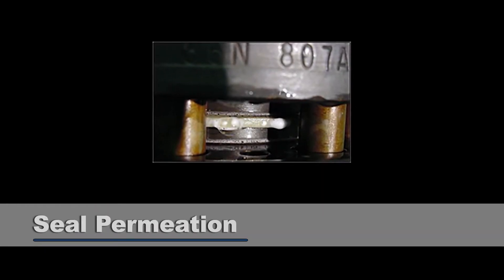The linebacker was invented around 1968, commercially available in 1972. This product has a GRE retainer with elastomeric or PTFE seals. The problem is that the design can have permeation between the two seals — as shown in this image, nitrogen at 400 PSI is permeating through the glass-reinforced epoxy. That's not surprising because when you look at glass under a microscope, it looks like a straw, and the media flows straight along it. Some clever people decided to cheat that leak path by making a tortuous path for the media using a different design like the PGE, where the media has to go around a couple of seals.